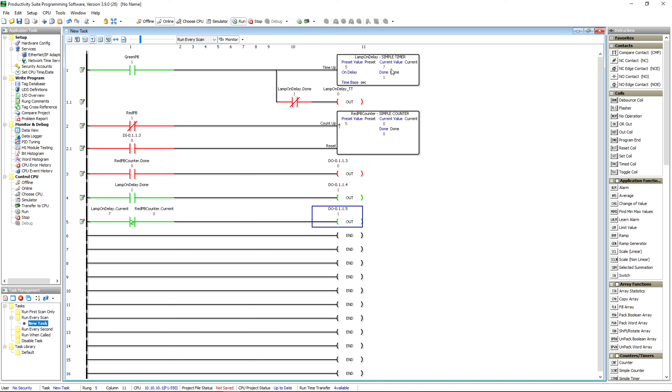When I push my button to increment the timer, the amber light is still on for a moment, but as soon as one value gets over the other it changes. Now with the timer still greater, I've got both an amber and a red stack light on. If I hit the reset and push the red button, the counter goes to one — and now the counter is greater than the timer, so the red stack light went off. When I run the timer and it becomes equal, the amber light comes on; when I let off, it goes away.